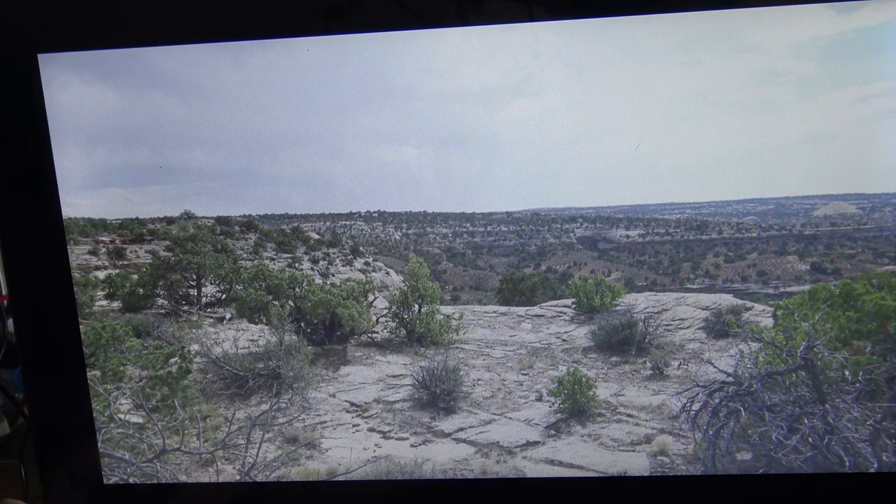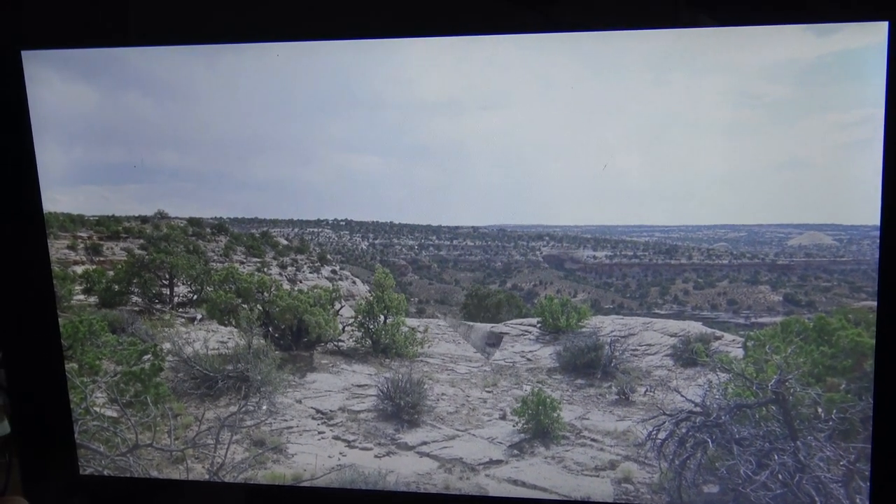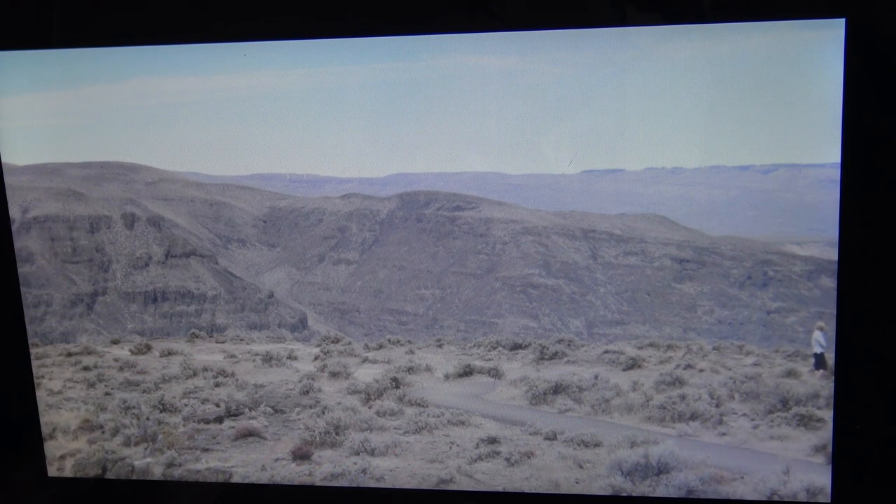It's an HD panel. A lot of these picture frames were not high definition — a lot of the smaller ones were 640x480 resolution, and a lot of the cheap ones out there are relatively low resolution. This one here is 1920x1080, so it is a full HD picture and it looks good. There's certainly nothing wrong with the picture on this, and I'm pretty happy that all that was wrong with it after all these years of use was one capacitor in the power supply. Even though the average person is never going to fix a power supply like this, I figured it was worthwhile to go through it and see what exactly went wrong — just for the troubleshooting side of things.